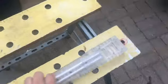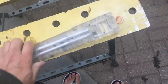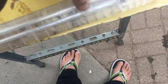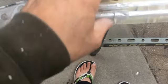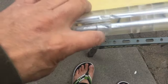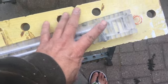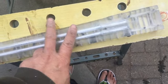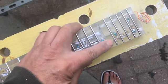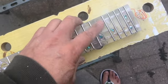Okay, so I've been sanding down. The problem here, you can still see the crack, but if you run your nail over it, I can't even tell what I'm running over. Here it is. And on this side, the slit, the spline goes from about here to here, and you can see it with some air bubbles in it, but all the cracks, you basically can't feel them. I was shaping it with 220 grit sandpaper, and have since polished it up with 220, 400, 800, 1000, 1500 to get it to this point. Don't know if you can tell on the video. It's pretty close, but it is a little cloudy, I would say, not as polished.